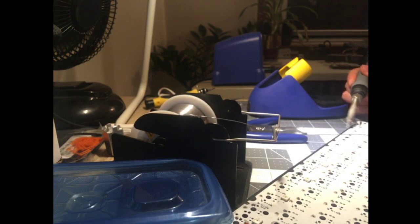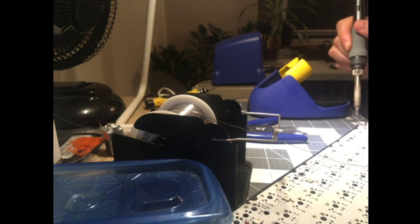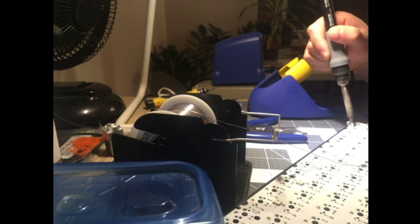So with this kind of solder, desoldering is pretty easy across the board, but if you have bent pins, it just makes it much harder to get a clean suction with the solder sucker. Digging around this USB port's always annoying.